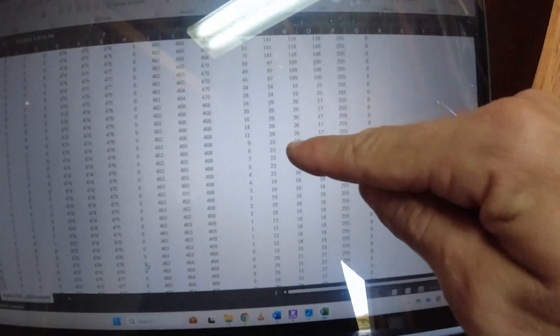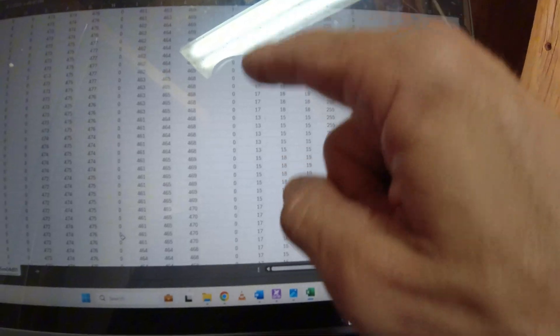The flow fell to zero. The overload tripped from that event - we got an overload fault, not a flow fault. The overload trips, the pump ramps down and stops. But then look at this: there's no flow for five minutes or more while there's still current showing on all three phases. So either the soft starter was running the pump at a very low current, which is really strange...